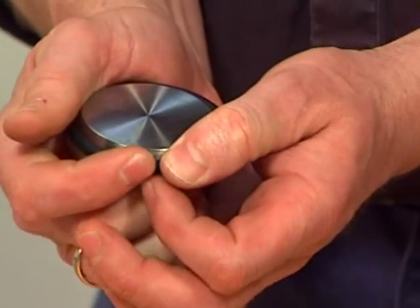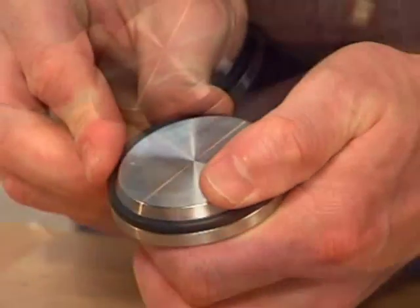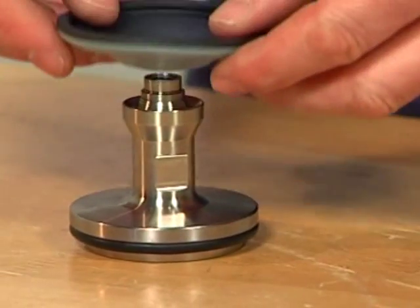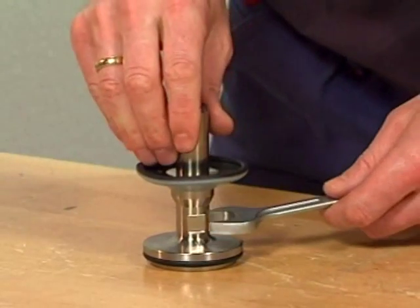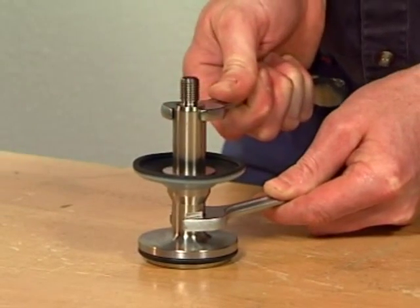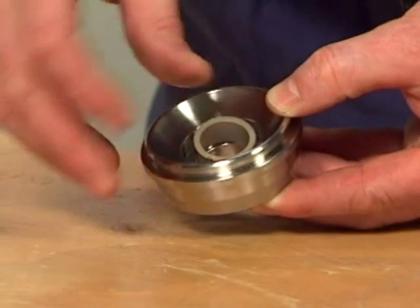Replace the plug seals. Place the new plug seal, mounting it crosswise to secure a perfect fit. Remember to release the compressed air behind the seal. Place the diaphragm and support disc, and tighten the two valve stem parts. Use two spanners to firmly tighten the two parts.